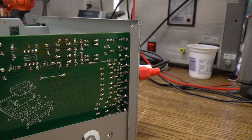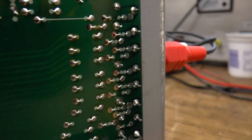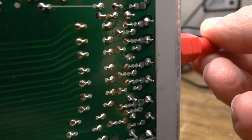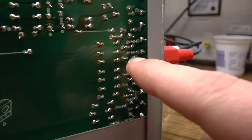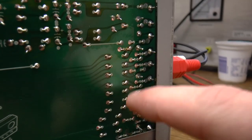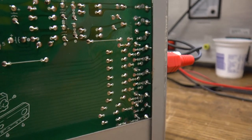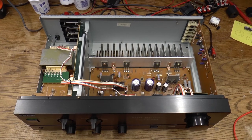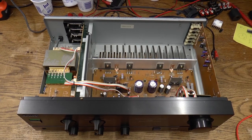The very first guess turns out to be the right one — more bad solder joints right there in the center of the picture. If I wiggle the plug or mess around with the circuit board, I can make the hum go away. So that's another easy fix. After repeatedly operating the switches and potentiometers, all the contact problems completely disappeared, so I think there is no need to bring out the contact cleaner.